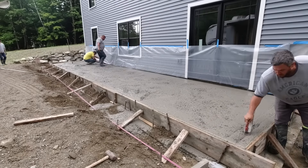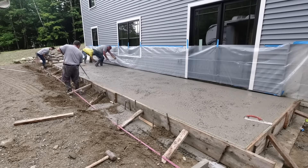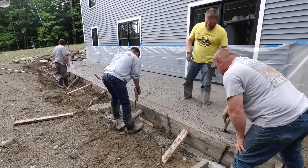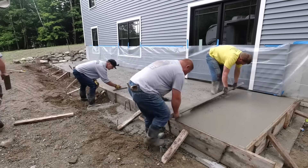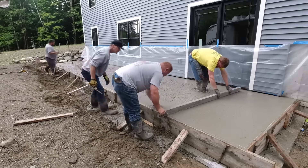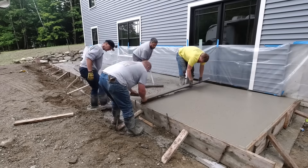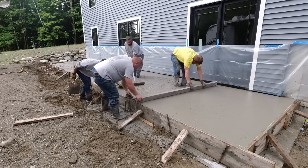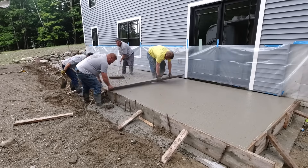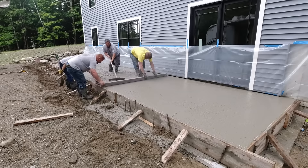We're getting the edges all magged up underneath that siding. Eric's putting in some rebar around the edges, and then we're vibrating the edges really good using our DeWalt pencil vibrator — I'll have a link for that down in the description. We got poly up against the house to help protect it from splatters. We string the boards to keep them straight, just tapping out on the kicker to get the board back to where we want it straight.